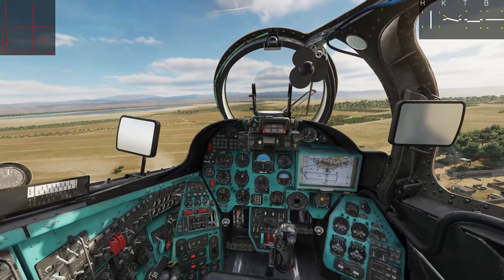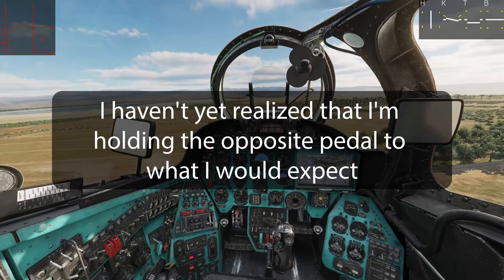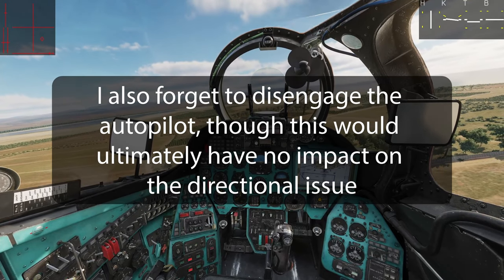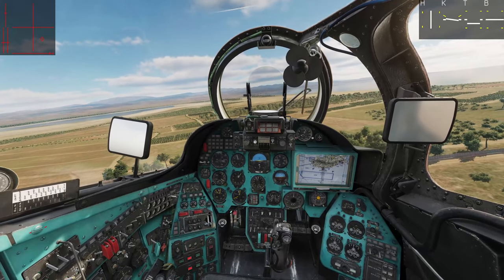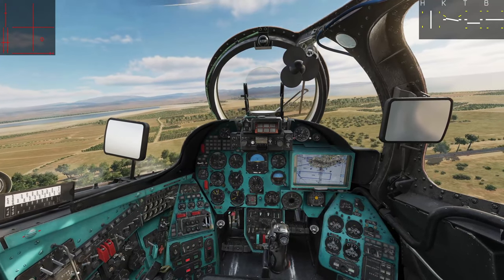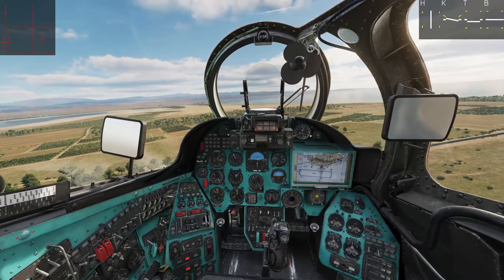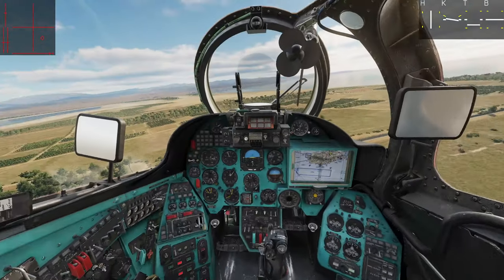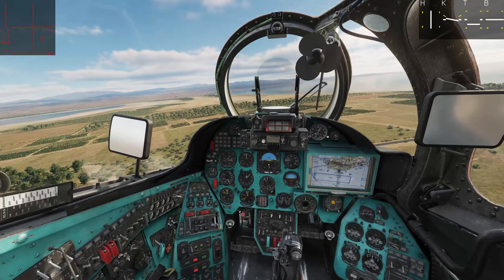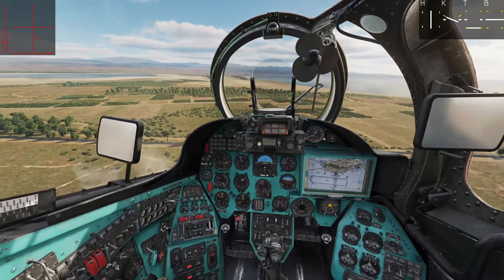And I just think it's because we have less tail rotor authority. This is a pro-torque tail rotor. The wind is trying to put you in a descent condition, and then you're trying to demand a lot of thrust. Yeah, it's tough. It seems to be much slower. Saturates a lot earlier than we did in left sideward flight.